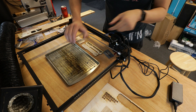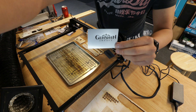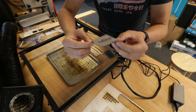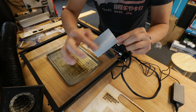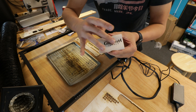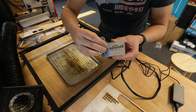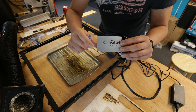This is a small piece of aluminum sheet — power at 300 mm per minute at 90 percent, almost like cutting a piece of wood. I don't like using thin aluminum because it's so thin that the heat kind of warps it, but it does engrave. You can actually feel the dent in it — basically the top part of the aluminum is burnt away, which is why it's black. If I rub it the soot comes off a bit and it becomes lighter. Usually what I do is just spray some lacquer on it to seal it.